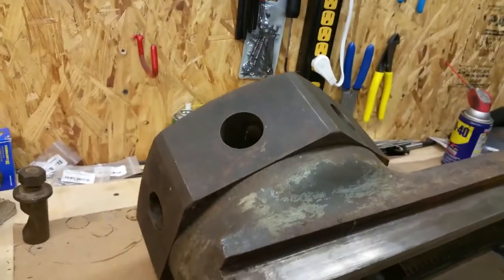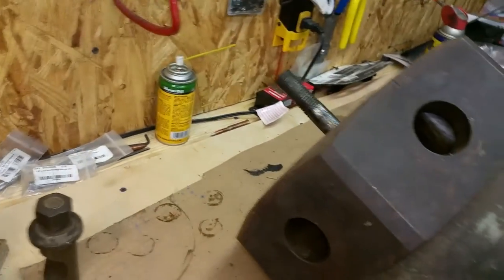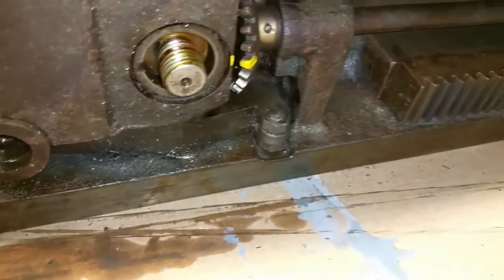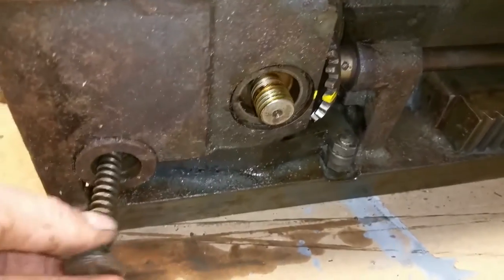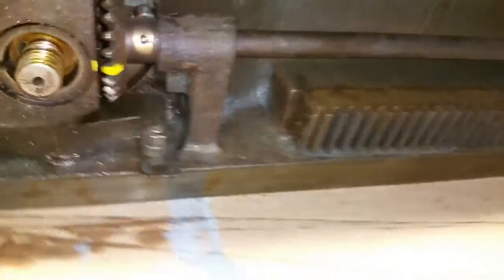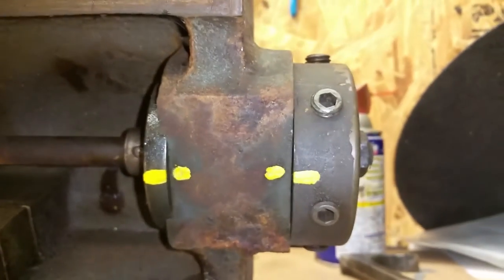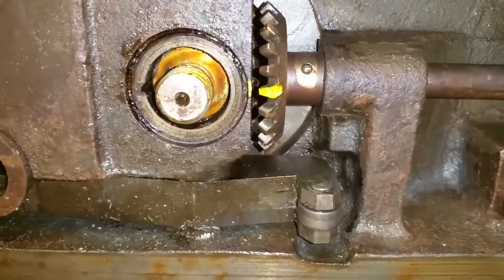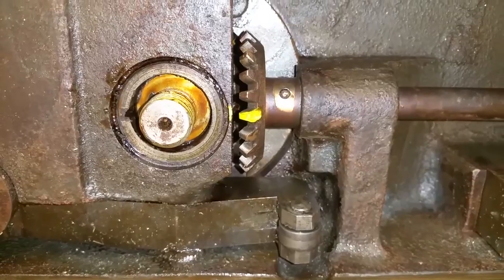No luck so far — I wasn't able to get the turret off yet. I got these out of the top to lighten it up. I did get the nut off the bottom but it's not sliding up yet. I don't know if it's on the taper or just stuck. The piston which locks the turret head was stuck — I pulled this spring out and managed to get it freed up. Now we can rotate. I'm going to get this shaft out — your all-threads need to be timed with the turret head. I put marks and I'm probably going to use a hammer and punch, hitting the same places marked with yellow paint. You want it timed right so that your all-threads are in the right place when the turret head locks in.